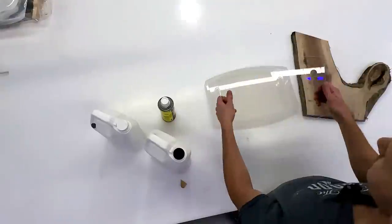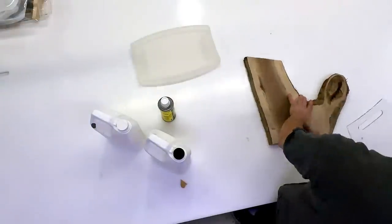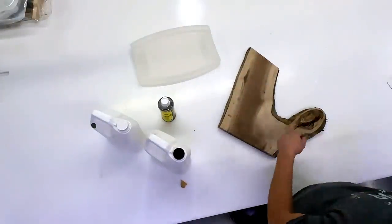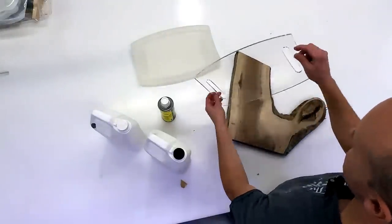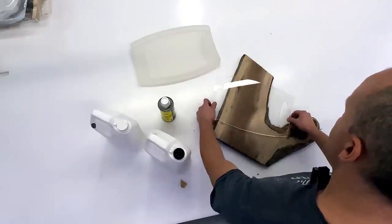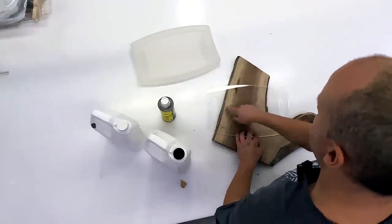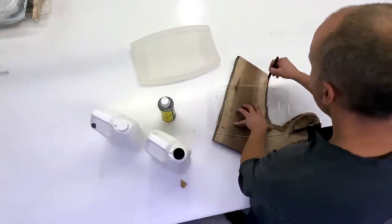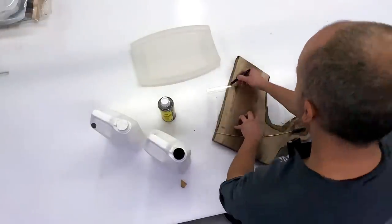I generally don't like to cut out the handles when shaping wood because it's still a very tight, very hard fit. So I'm going to put the template to the side, grab a piece of wood — it's a little wonky, but it'll serve the purpose. Being clear acrylic, you literally get to preview how the wood is going to look in your mold. I'm going to position it to include some of that walnut crotch without interfering with the handles, then trace the line around the template with a pencil.